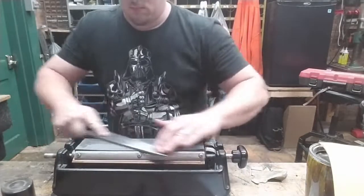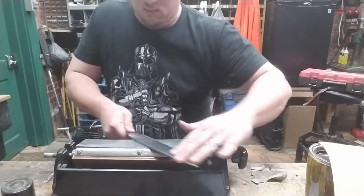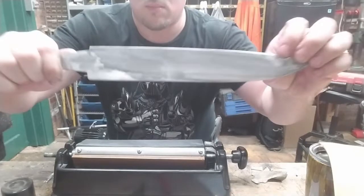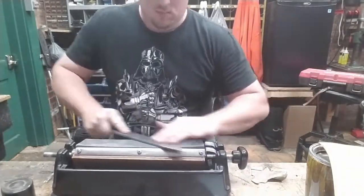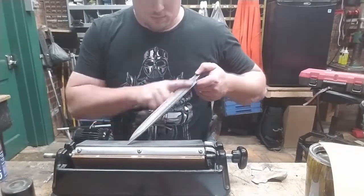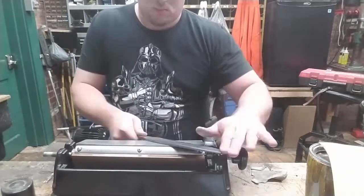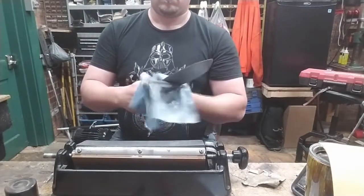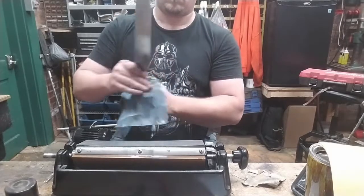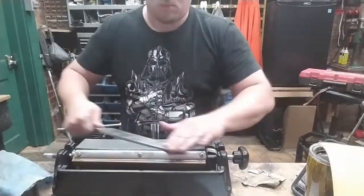So if I'd taken a rotary grindstone, and I actually have a broken rotary grindstone, and that's a project for probably another year, it would have been authentic to work on that. But I did all of this with handwork. And here you can see I've gone over to some flat, coarse stones, and I'm thicknessing the edge of the blade, getting it really towards an edge. I don't actually want a very sharp blade because it hasn't been assembled yet, but I get it down to about 1/4 of a millimeter, where I'll stop with the sharpening of this blade.